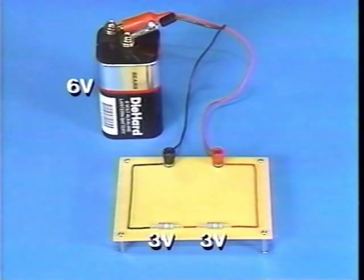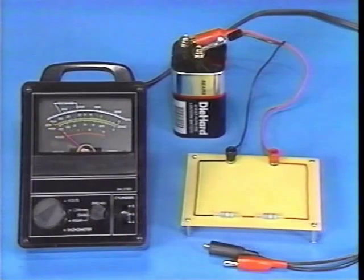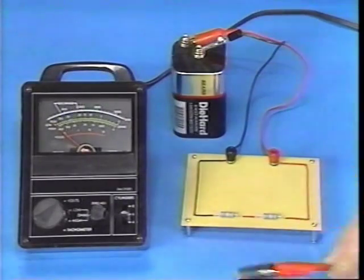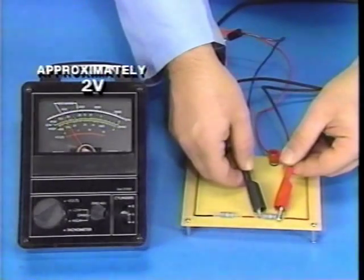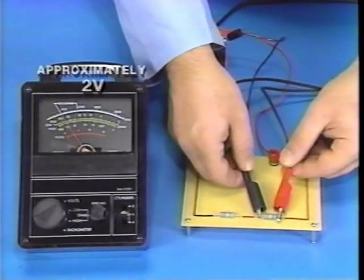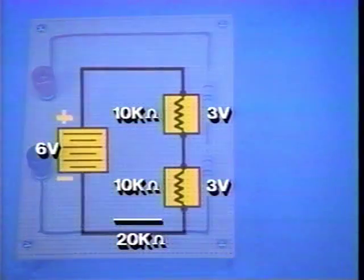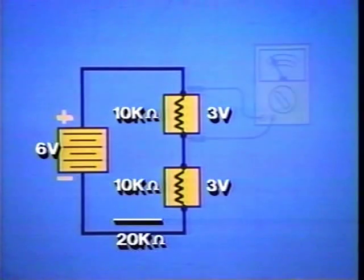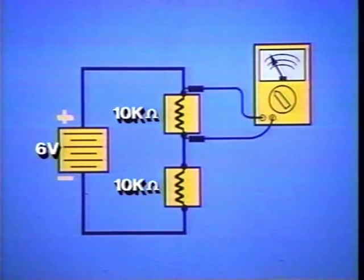This series circuit contains a pair of 10,000 ohm resistors. When connected to a 6-volt battery, each resistor is said to drop or consume 3 volts, and the circuit drops a total of 6 volts. A voltmeter connected in parallel with one of the resistors is therefore expected to read 3 volts. This particular meter reads significantly less than expected — the meter's high current flow design changes circuit resistance and causes inaccurate readings. Connecting the meter causes the circuit to behave differently, placing a parallel load on the circuit.